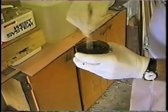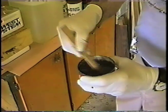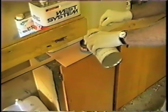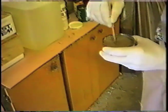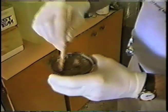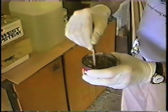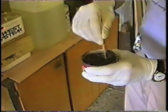That does turn dark. If I used the regular sawdust — even the real fine sawdust from cedar — it would turn just as dark. So the filler blend is dark and the micro light lightens it up. I used to use rock-hard wood putty the same way because that was a light color. But when I first started, I used wood putty by itself and it dried almost white, and that looked worse than the cracks did. I'd rather have it on the dark side than the light side.